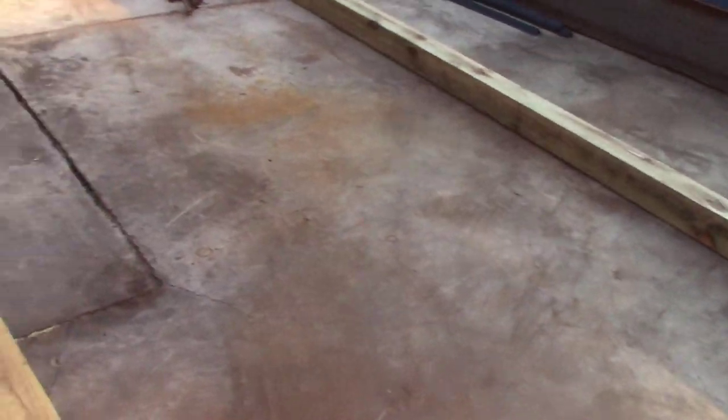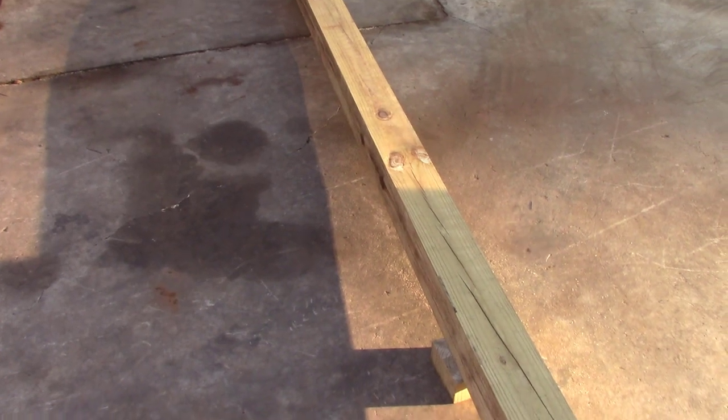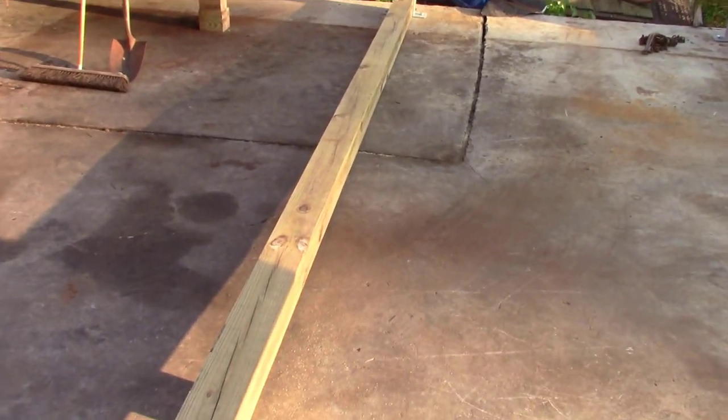We'll get two 8 foot 2x6s, and we'll get ready to put them on, and we'll square these posts up, and then we can start figuring out where our layout's gonna fall. So let me get started on that. I'm gonna do the layout first.